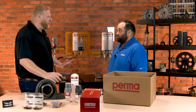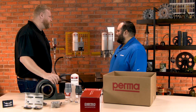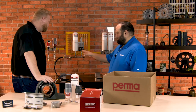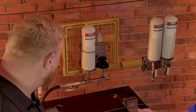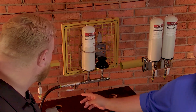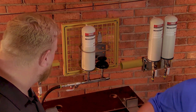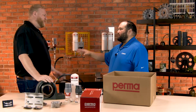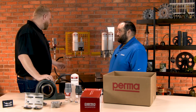As far as extending it out, what kind of length are we dealing with? The Star Vario is good up to five meters, or a little over 15 feet — that covers most applications. Also, what are we dealing with with this little check valve? The valve in here — because this line can become clogged with grease, or the grease may degrade especially in hot conditions — PERMA has thought about it. We can valve off the lubricator, and there's a grease fitting to where we can disconnect the line, purge it out, deal with contaminants, troubleshoot, or just purge the line in general and charge it with new grease. Great fit for that little valve.